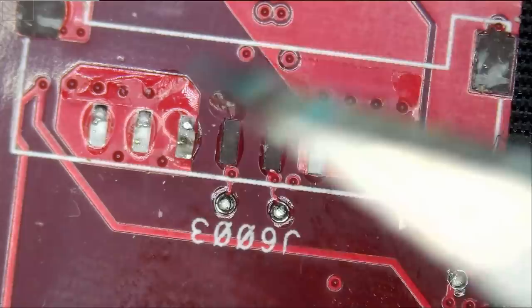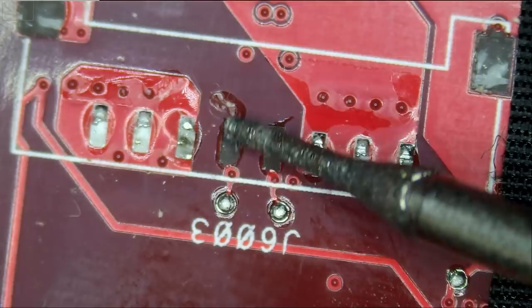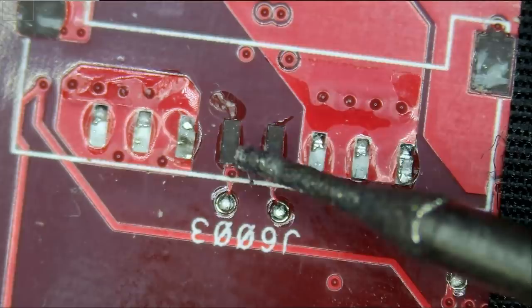The first thing I wanna do is, should we grind or no? To grind or not to grind? I do see the pad is connecting all the way here and all the way here. So right now there's no reason why I should grind this piece. We can connect the pad strip from here to here, from here to here. So we're not gonna grind.